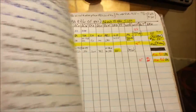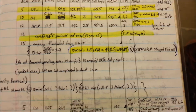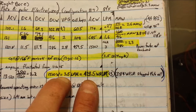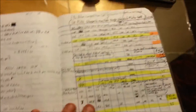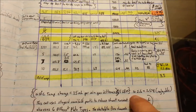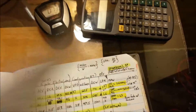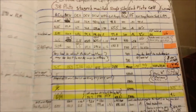The other cell would not do that — the most it got was about 3.5 liters per minute. This is a 38-plate bipolar with the staggered manifold, and it also only achieved about 3.5 to 3.75 liters per minute. So even though I'm one plate shorter, this new design — the non-staggered manifold versus the staggered manifold — outperforms it.